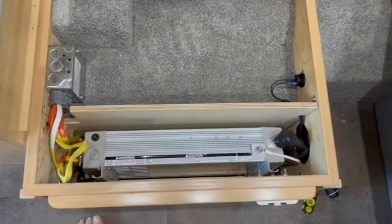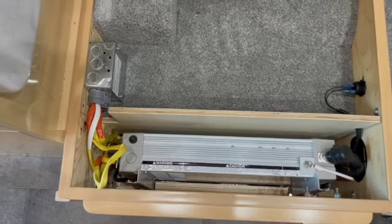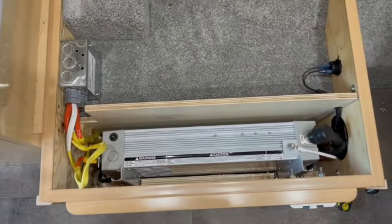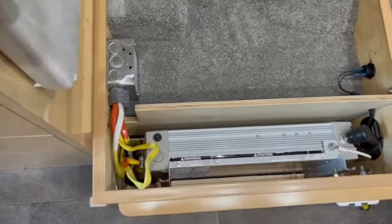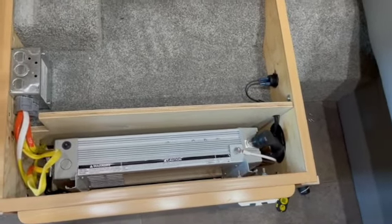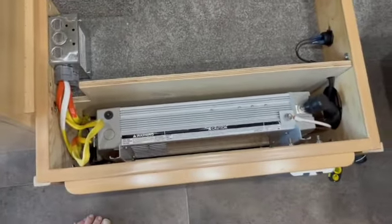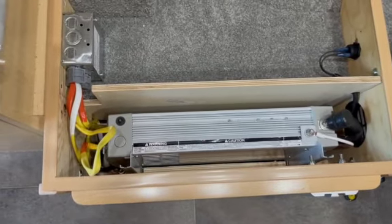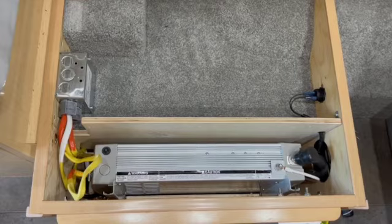And the reason I want to do that is that this is 12 gauge wire, which is good for 20 amps. And if I pull 10 gauge wire through, I'll be able to get a full 30 amps out of it. So that would mean I'd be able to put in the 3,000 watt inverter and actually use all the power. Previously I was thinking 3,000 watt, but I would only use it to 20 amps because this wire is fed through a 20 amp breaker, so you're limited to 20 amp use on this line. But if I can get in, upgrade the wire, that gives me a little bit more headroom on the power.